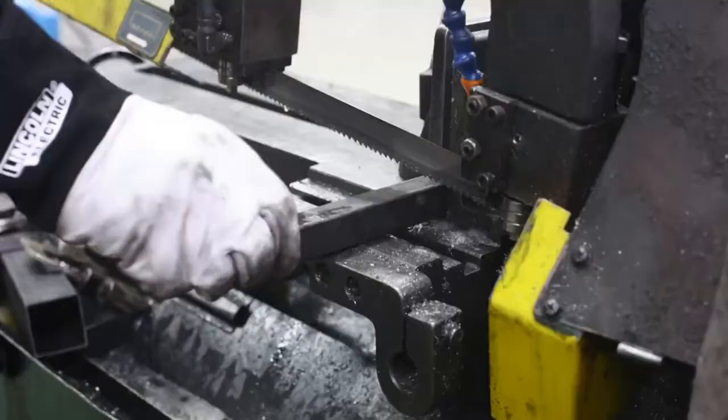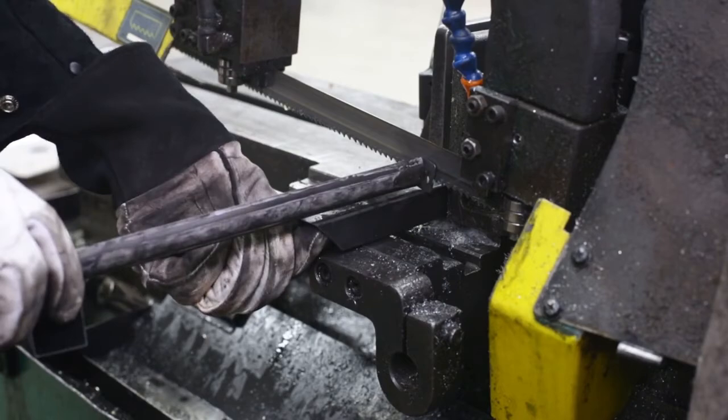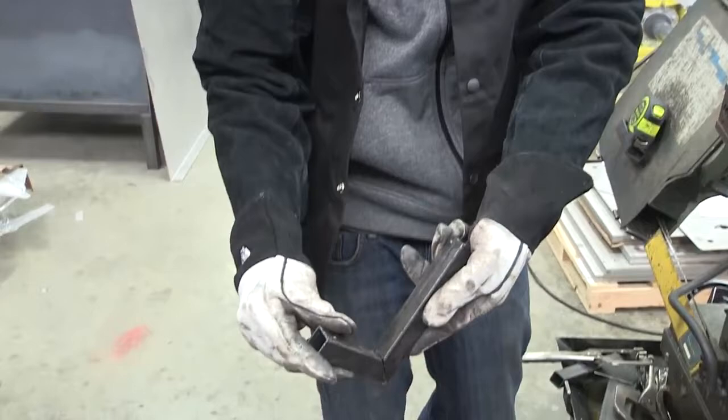These are our legs, but we've got to cut it off at a certain length and switch it over so it makes a 90 degree. I decided to go with four inches on this one — keeps our table nice and level, nice and strong on stability. So four inches on this piece will give us a three inch under gap. We take these pieces from the same one, the seam lines up on the underside, and it makes our legs perfectly.